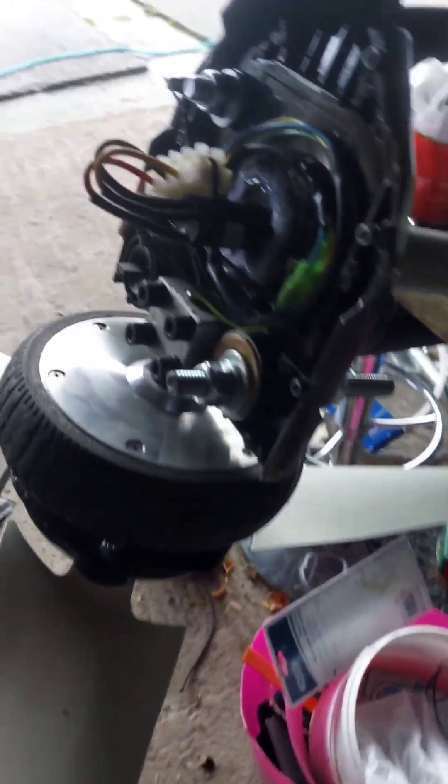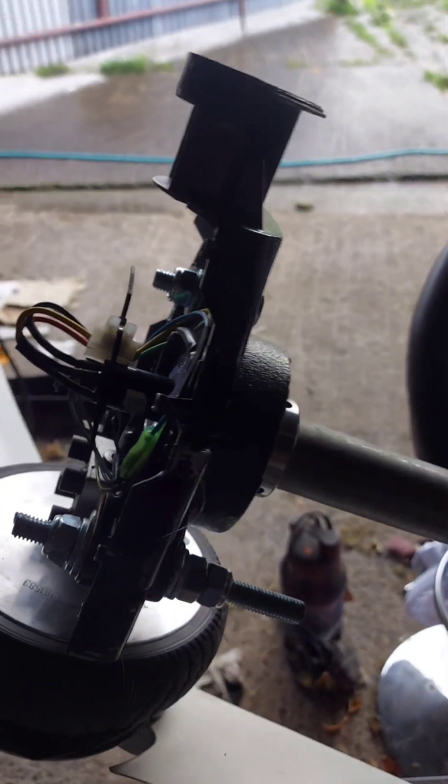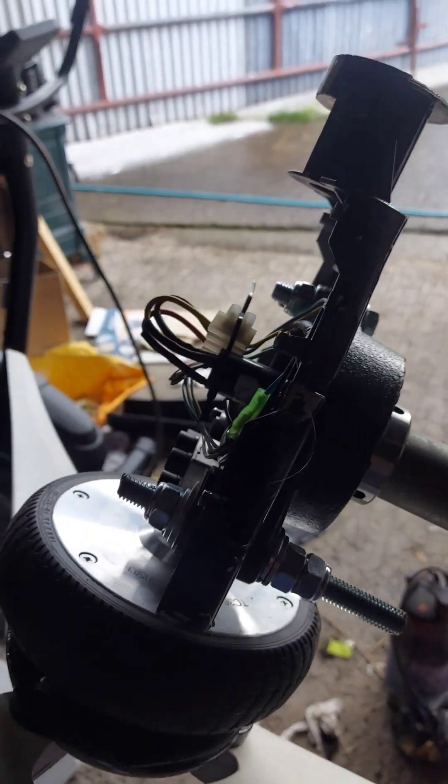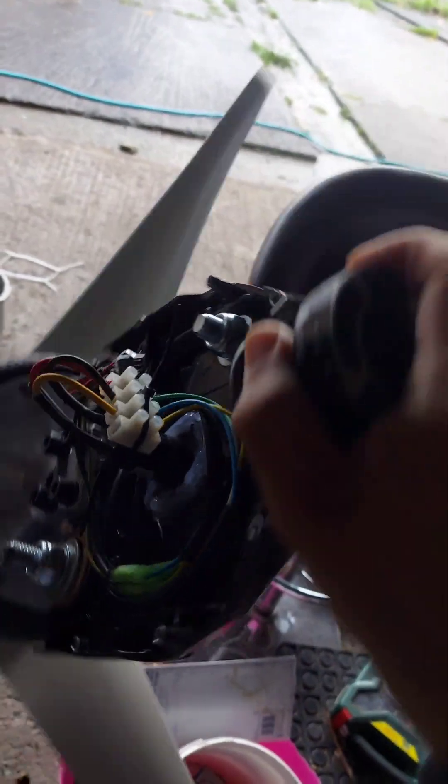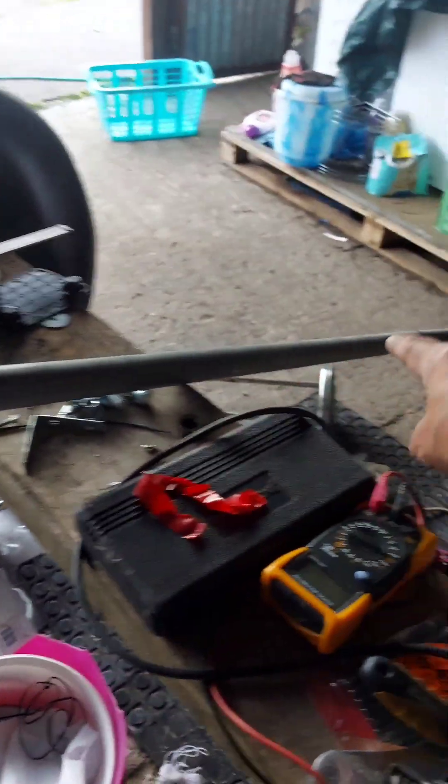You can see it's swinging nicely — my pipe stays in place. A good example: the slip ring is moving with the body, but my wires inside the poles are not twisting because the ring in the middle is moving while the wires stay steady. My slip ring moves with the body and rotates 360 degrees, while the wires coming through the pipe stay steady.